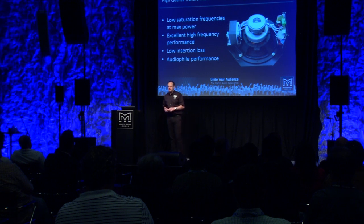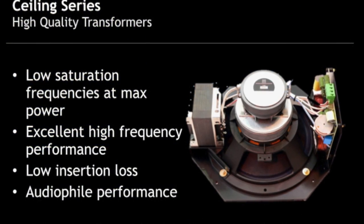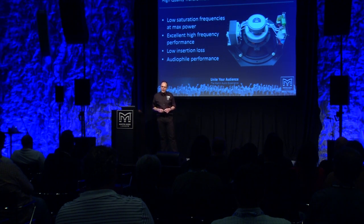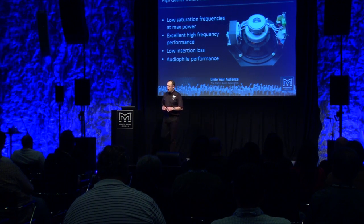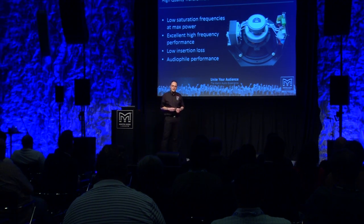We're very proud of the sound quality of these loudspeakers, and part of that is achieved through the fact that we use very high-quality crossovers specifically designed for the loudspeakers and high-quality input transformers. These are designed to saturate at very low frequency — they don't saturate until 40 Hz at full power, which is outside the passband of these loudspeakers, so you still get full low-frequency performance whether you're on a low-impedance or a high-impedance distribution system. You also get a very soft roll-off at the high frequency and low insertion loss — less than 1 dB across the entire range from the smallest to the largest.